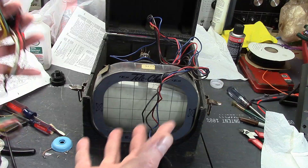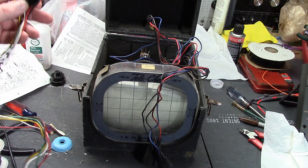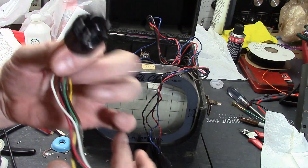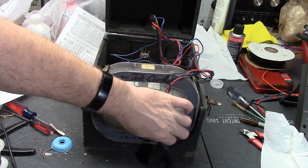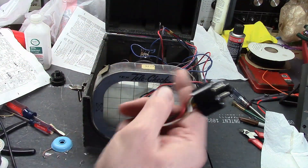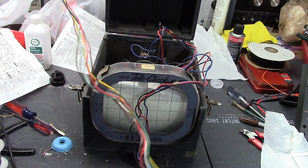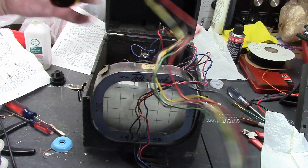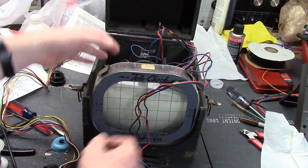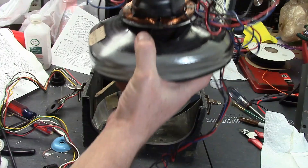So since this one is falling apart, what I want to do is customize it just for Predictas. Put this on the base like it was originally intended, cut off this and put on the Predicta plug. Take the yoke, cut off these and put on the Predicta plug. So instead of being universal, this would be custom tailored to plug directly into a Predicta, and I would use leads as long as I think would be practical.